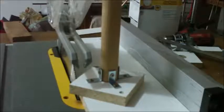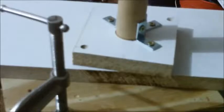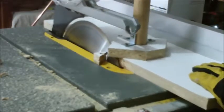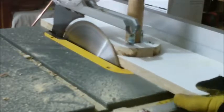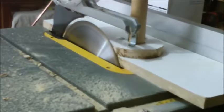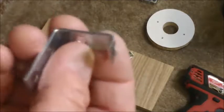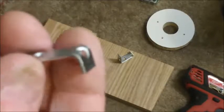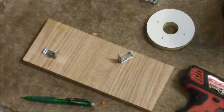So this is the way the jig will be set up. It's better to turn the piece this way and then slide it through, cut off all these 45 degree pieces, and then come around and trim it. So this looks really good. As you can see it will just fit inside this pipe. Then I'm going to put three angle irons on. I couldn't find quarter inch angle irons so I bought some one and a halfs and bent those about a quarter of an inch in so that they will fit on here and give plenty of support outwards, so that the piece that's being glued will be able to set up against there firmly and be level inside the pipe.